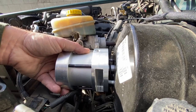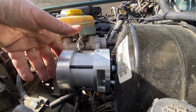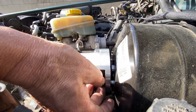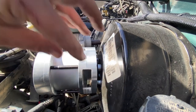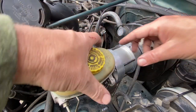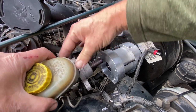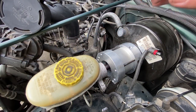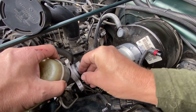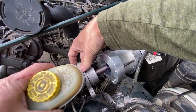O-ring in place, and each step of the way we're going to have to make sure that O-ring stays on. We're going to have to get the nuts on first, because you can't put the nuts on once it's all the way pushed back. The first nut is on. Now before I tighten it I get the other one and the O-ring in place. Fit is achieved, but that little gap means it's still not adjusted properly, so this thing has to be turned in a little bit. Iteratively we have to keep putting it back together until we get that to the right dimension. The actuator length is now adjusted properly — that's part C in the instructions. Now to put the O-ring back on, and this is going to be the actual install run.